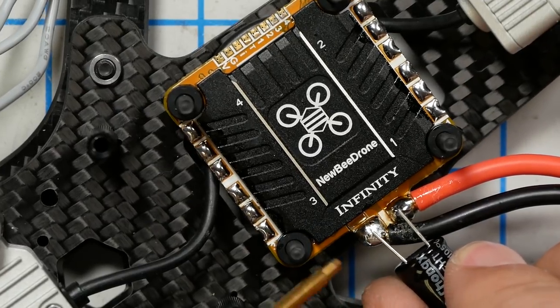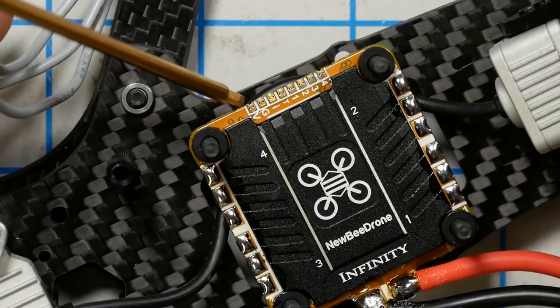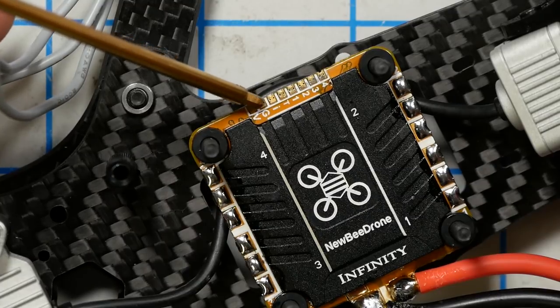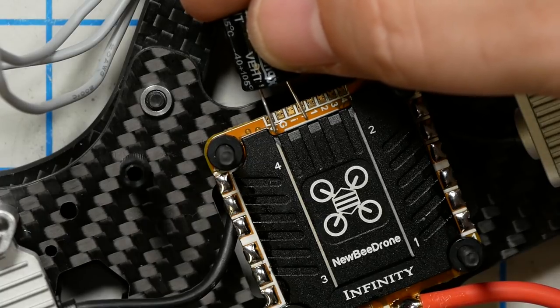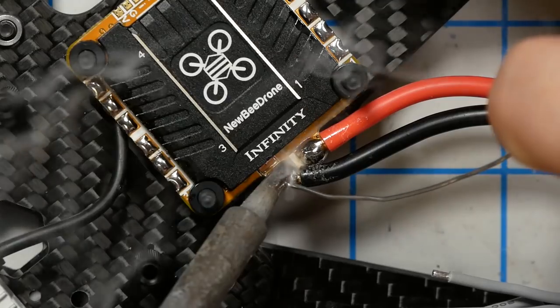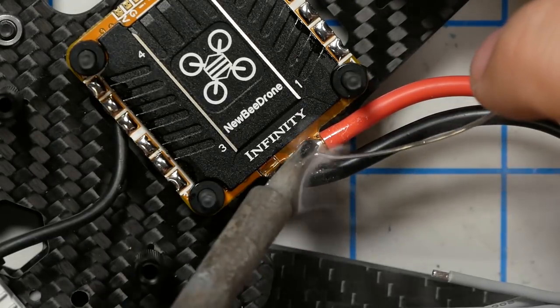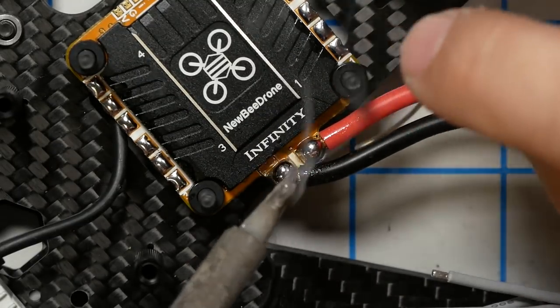And that's how a lot of people would do it. You just add a little extra solder on top, but it's risky because if you flow the whole joint, then the whole thing pops off, and it's not too hard if you know how to do it. There is also a V and a G pad here, and since we're not using those, we could solder there, although they're so close together, it's going to be pretty tricky. I think I'm not going to do that. I'm going to solder here. You can solder the capacitor with a wire too, but it doesn't perform as well if it's not directly connected. We're going to just gently build up a blob of extra solder on top without applying enough heat to flow the whole thing.